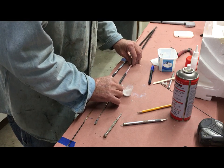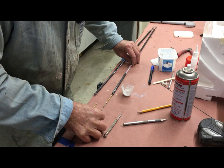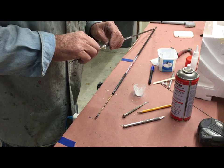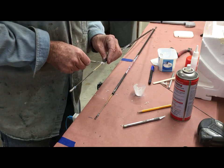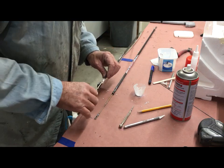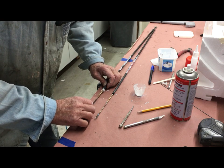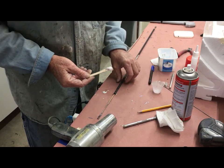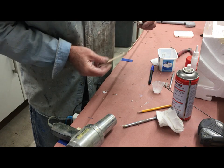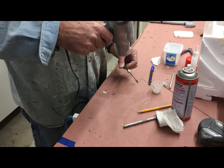It's not gone too far. I'm lining the bottom end which you can't see on the film. I'm gonna push this guy in now to 36 — twist it, get as much on the tube as I can and that'll be dragged in. The other end's on the mark and this guy is now feeding in. The heat gun helped set the epoxy deeper inside, and now I'm just going to use the remaining epoxy and wrap it around to create a jacket. Give it a shot with the heat gun and that'll help it set up quicker.